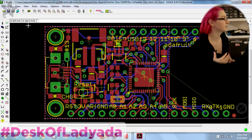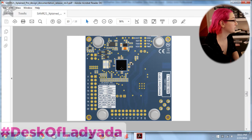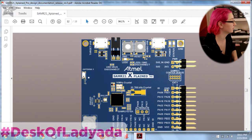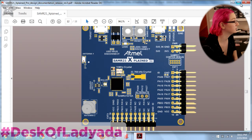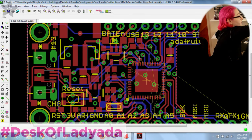If there is a suggested antenna design, you should use it. In this case I'm going to use the same layout and components as best I can. I won't use the analog switch, but I'll use the same components for the rest of the RF front end. If they took it through FCC certification, it means I'll have a much easier time going through the process myself. There is a module for this chip, but it won't fit in the feather layout, so trade-offs.